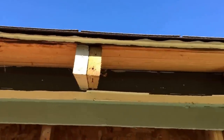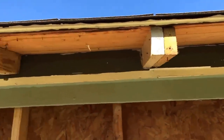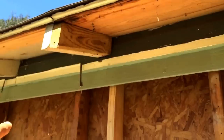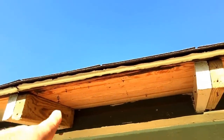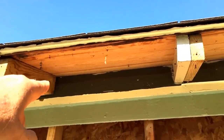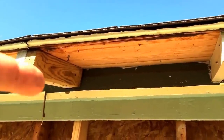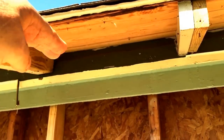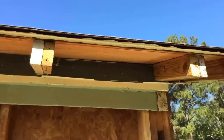I've got one, two, three more rafter scabs to get off, and then the last two pieces of siding will come off. I'm hoping I can reach way up in there, because I have a ceiling inside and can't access the rafters from inside. I'm going to reach up as far as I can with my drill and drive some screws, hoping I can go three or four feet in with a new two-by-four and scab on again — do it a little better this time.